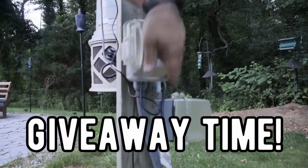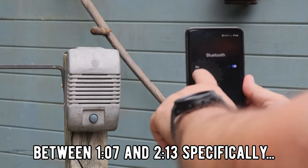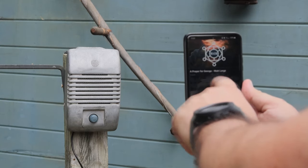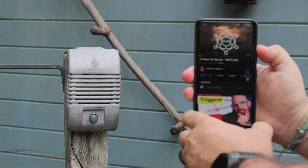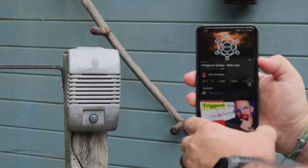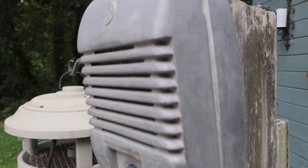Now it's time to put this bad boy up in the backyard. I'll pick a winner in the comments, by the way, for a pencil with a belt sheath and some stickers if you can guess the songs, song and band, in the order they were in the video — this is up until I switch over to the licensed music I use from Music for Making, which is another channel I run. Another cool little thing about this drive-in speaker design is that little clip there fits right on this pole that I have in the backyard, which used to be there for the above-ground pool, which is no longer there and is now a patio.